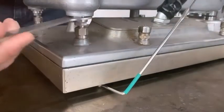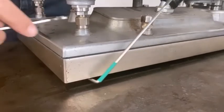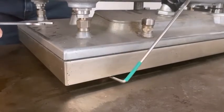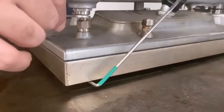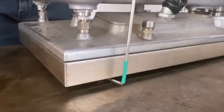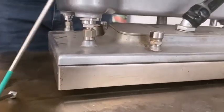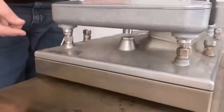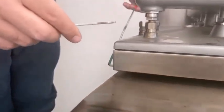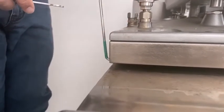So on the right hand side, just going to undo the locking cap and then we're going to bring this down. I'm just going back and forth. Now it's stopped. It's gripping just a little bit out so I'll just go a little more. So now that stops in line the same as the other. Because we've made quite a big adjustment on the right hand side, we're going to have to go back and just verify the left. The left is loosened up slightly — it now allows us to go back an inch — so I'm just going to make another minor adjustment. And now that's back to stopping in line with the adjuster.